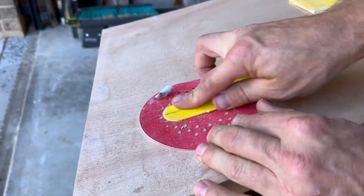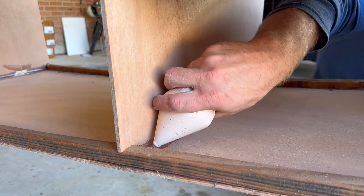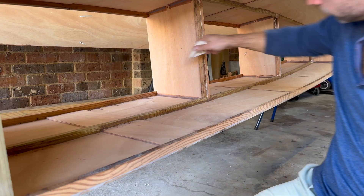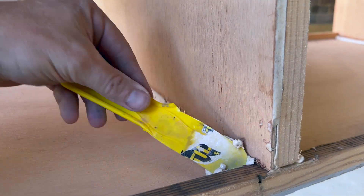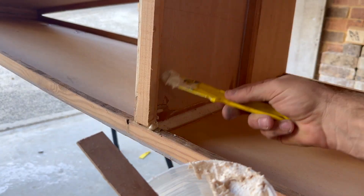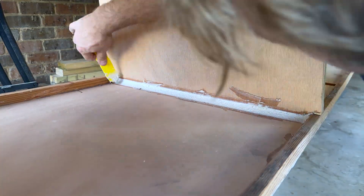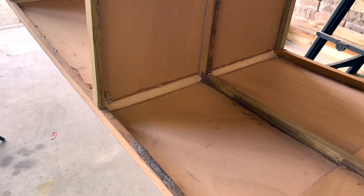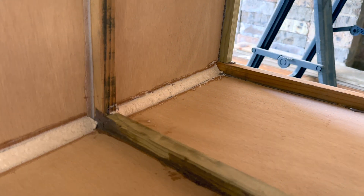Before I started making the comings for the hatches, I wanted to complete the filleting process. That means I needed to make a 40mm wide tool to put some really big thick fillets over the initial ones — you can see that's going to cover those up beautifully, add to the strength, and also importantly separate the watertight bulkheads fore and aft as well as the little storage hatches underneath the cockpit sole. The filleting process is simple: squeeze all the thickened epoxy right into the corner, then make sure you have a nice clean curve in and out of the corner to transition the load between the two surfaces. A nice clean job — just like that.